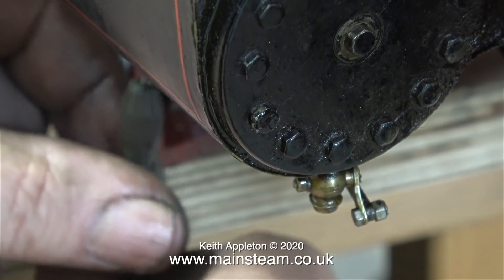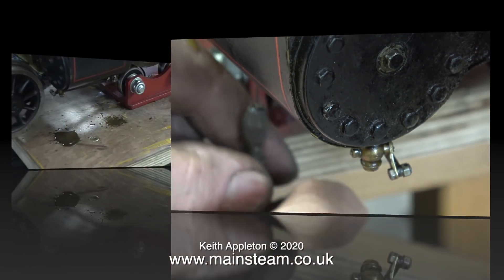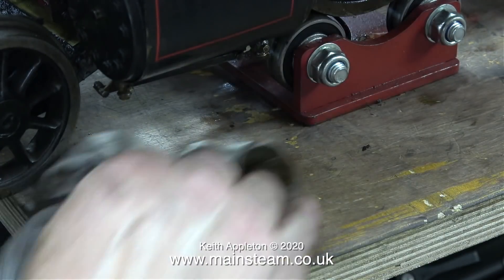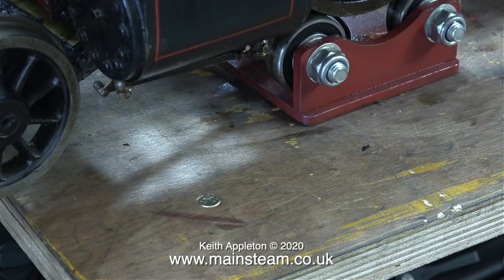This is the last one for the treatment — it's the rear one at the right-hand side. In order to do this one I had to pull the locomotive over the edge of the bench. All I had to do now was verify that they worked. I pumped a lot of oil into the steam inlet, connected the airline, and here you can see an oily mess underneath each of the drain cocks.